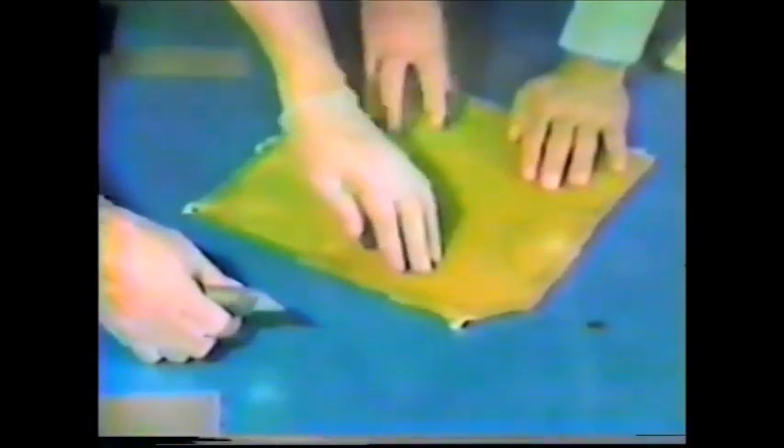This has been in cure for four or five hours. It's still tacky — if you push down on the sides it feels about as stiff as a stick of chewing gum. If it's more flexible or less cured than that, it'll be difficult to knife-trim without disrupting fibers. If it's fully cured, it'll be difficult to get the knife through the epoxy and you'll have to saw and sand the edge. Since we've caught it at the right time, knife trimming is straightforward — just stick the knife blade in carefully and go across to remove the excess, giving a smooth joint. Be careful not to slip during knife trim and damage the part requiring structural repair.